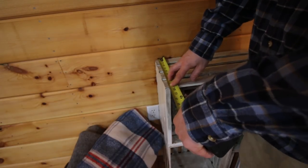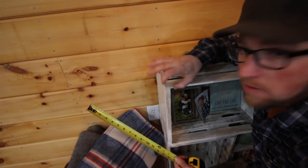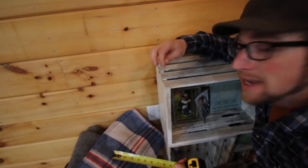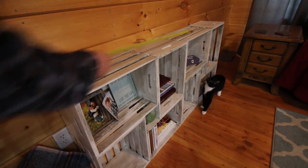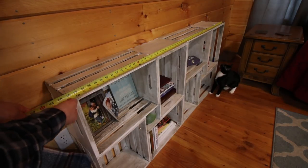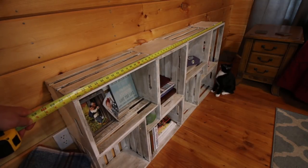So the same all the way around. We're going to have half an inch to 3/8 of an inch overhang. What that tells me is I want to match the side reveal with the front overhang — so whatever we have on the front, I want to have on each side. So now I can get my length and cut it down. Then we can get the finish on it. So 61 and a sixteenth long — I want to go 62 and a sixteenth long.